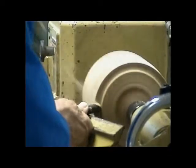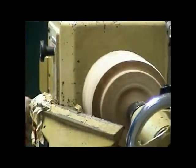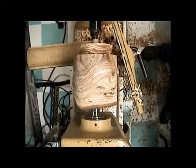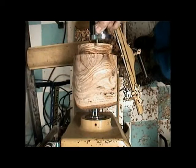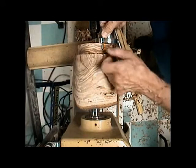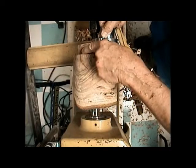The next cut goes in about an inch, inch and a quarter. What I want to do is leave enough room ahead of where the screw goes so that it won't leave a hole in my form. When the screw goes in it makes an opening ahead of it. So there's the room ahead of the screw where it can split out a little opening and not be in the form.